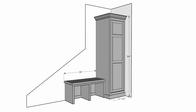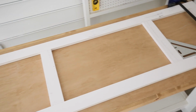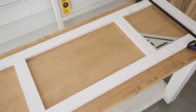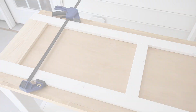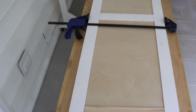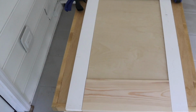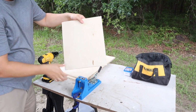using 1/2 inch plywood framed out with 1x3s and a 1x6 on the bottom of the door. First we cut the boards for the frame of our door, then clamped them together but didn't attach them yet, so we could figure out our 1/2-inch plywood cut measurements. For the door design, I created 2 equal sections of the same size and 1 smaller size section. Brandon added pocket holes along all of the plywood sides and on the center door frame board.